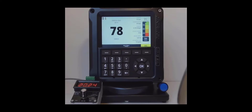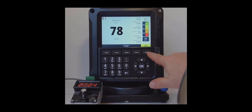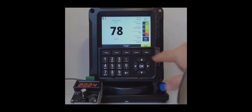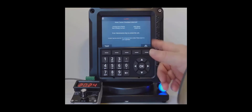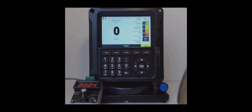For my last example, I'll show you what happens when the current is above 20 milliamps. I've set my simulator to be above 20 milliamps and send a signal to my IQ register. You'll see my WaterSense Live value is already over 50 parts per million. When I hit start, the light comes on, the delivery starts, and very quickly the system shuts down and goes into an error — my blue light is flashing rapidly. I have my WaterSense shutdown detected error message and it's asking me to enter a maintenance key. Again, if I press OK, I enter my maintenance key, press OK, and that will clear the message.